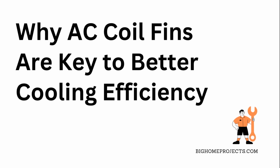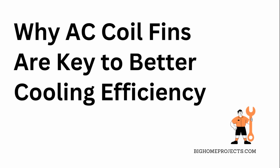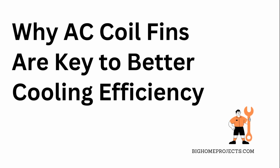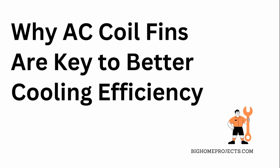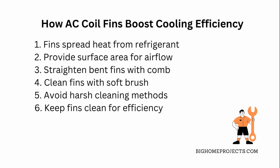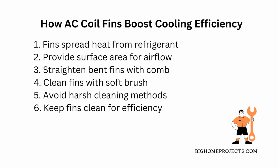All AC parts work together to keep your home cool, but those fins on the coil are like the unsung heroes that help spread out heat and make sure your system soaks up the warm air properly. So, check this out. The fins on your AC coil are those thin metal strips you see packed tightly around the coils. Their main job is to spread out the heat from the refrigerant inside the coil to the outside air, or vice versa if it's a heat pump.